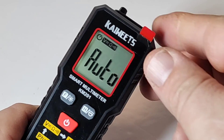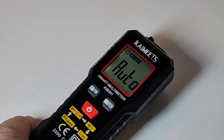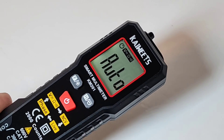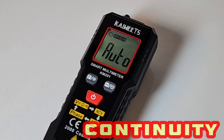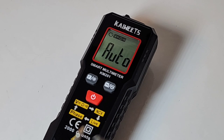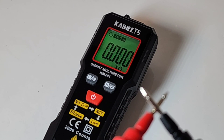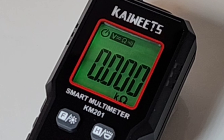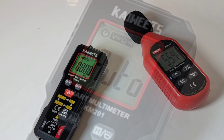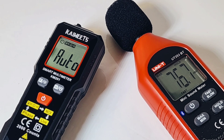I got so excited about this meter, I forgot to take off the protective cover. Pardon moi. There you go — all exposed, and man, that looks amazing. We also have a little flashlight, and when you enable the flashlight, you don't turn on the backlight, which is a bonus. We have a really nice, very even backlight with no bleeding whatsoever. The backlight stays on indefinitely until you decide to turn it off. Next up, continuity. This is a smart meter so it takes a while for the relay to kick in — at least a second. It's loud and latched, and we have that nice visual indicator, a nice green hue coming up on the display. 76.7 decibels maximum output volume in continuity, and that is indeed loud.